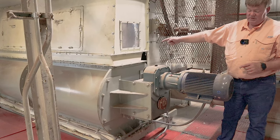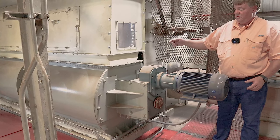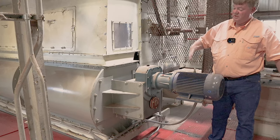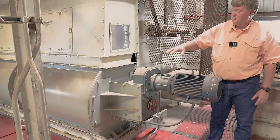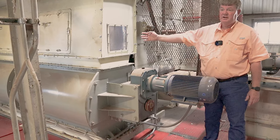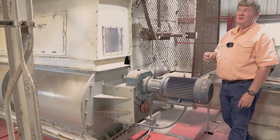And what it's doing, like I said, is we've got that air blowing underneath. Well, we don't want it to suck air out of here because we're still on the suck side of the fan. So we want it to pull air from out there. If we didn't have good flashing in here, we'd suck all of our air right here, and we wouldn't have enough air to satisfy our burners, and we couldn't run our heaters.